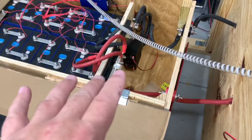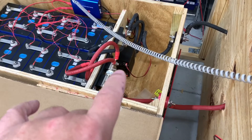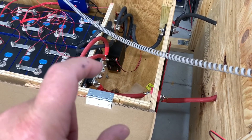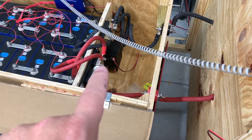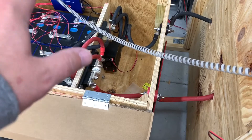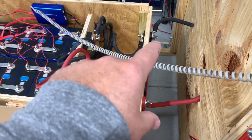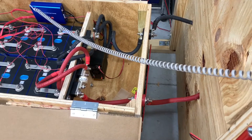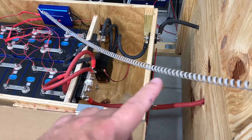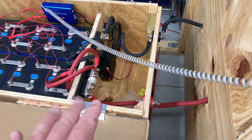With all those problems, what I'm going to do right away, after some research, is go back to an actual physical relay — a DC contactor, not a solid-state device — with a proper pre-charge circuit. What I want is: when this tells the relay to be off, it's off — no voltage present, no electrocution risk. I want that relay fully disconnected. And I want the pre-charge circuit to energize, giving the resistor five to ten seconds to charge the capacitors before the main relay closes. That's how it should operate, and it is not doing that. I'm done with this thing.